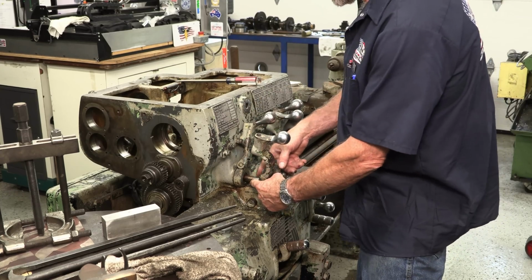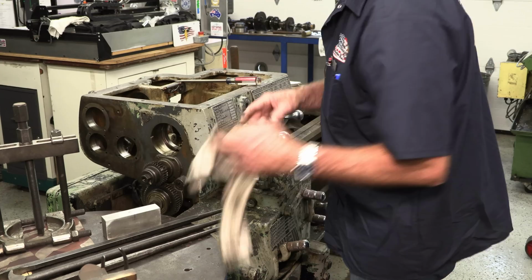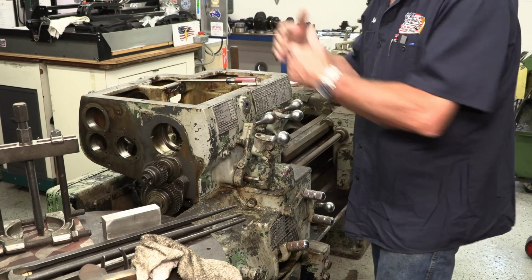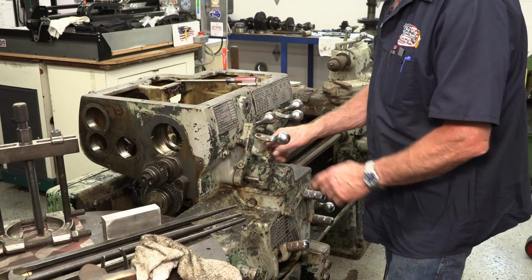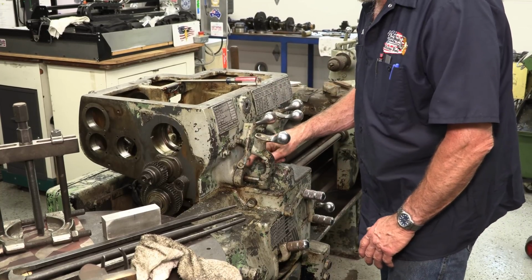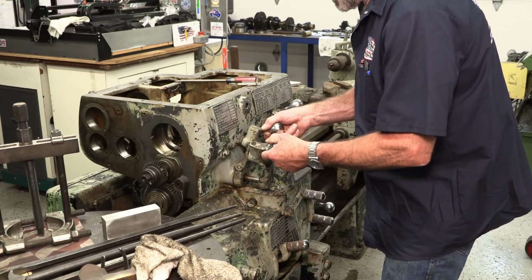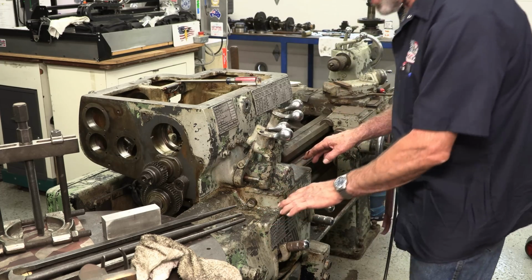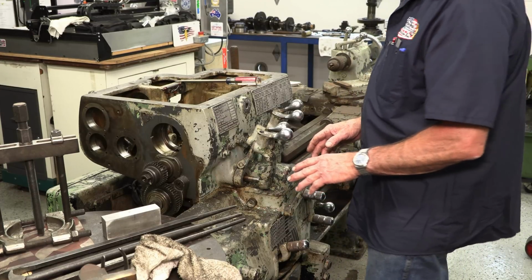Because there's a key going through that yoke on this shaft. This shaft is the same size all the way, except I think the very end goes into a little pilot or a bushing or bearing area that might be a little reduced. We'll see when we get that out of there, because everything is hidden inside each other. There's probably some O-ringage going on between these pivoting areas and the gearbox, because there is oil here, and I'm sure that they are old and not doing their job anymore.